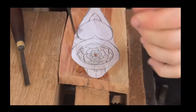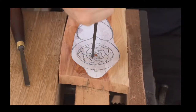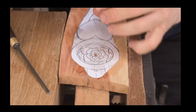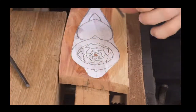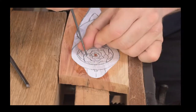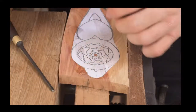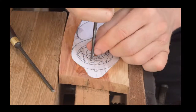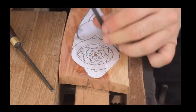The process of carving like this is basically making a series of stop cuts — creating that barrier is the first thing you're doing. Depending on your carving, you can do it in different ways. Some carvings are easier where you do stop cuts and use them as a barrier straight away, but with this one I like to mark out all of the petals and all of the stop cuts, and then afterwards do all of the detail on the petals.